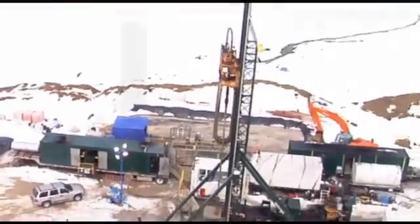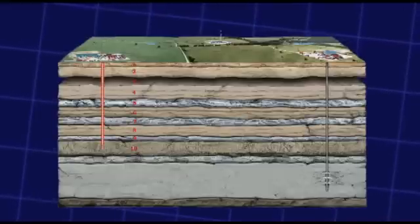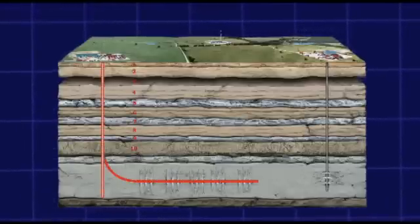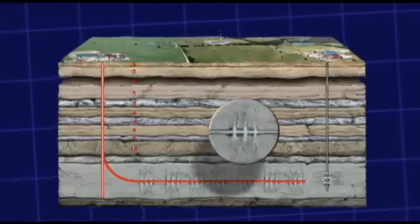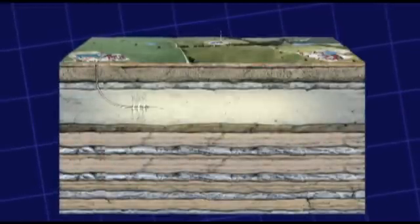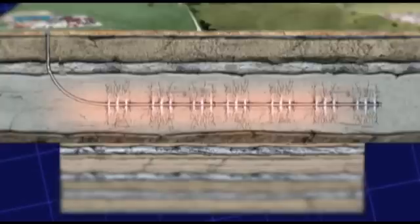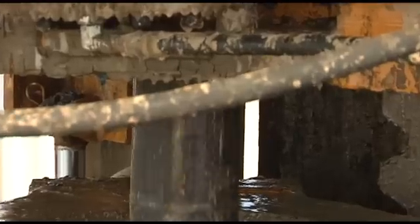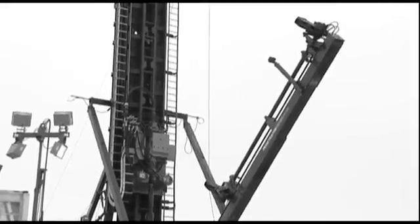Looking for a bigger pay zone? Get the VR500 Advantage. Directional drilling for energy with the American Directional Drill VR500 will expose more feet of casing to the pay zone when compared with traditional straight vertical drilling. Better yet, the VR500 drilling system can do this at extremely shallow depths, since it uses rack and pinion thrust rather than gravity to load the drill bit. No pay zone is off limits because of being too shallow.